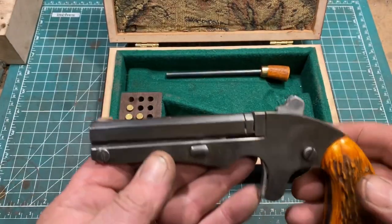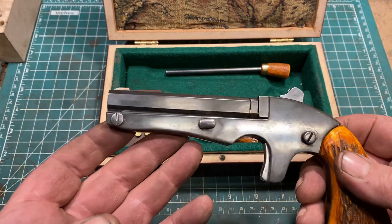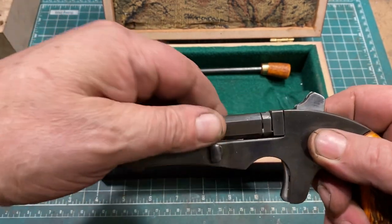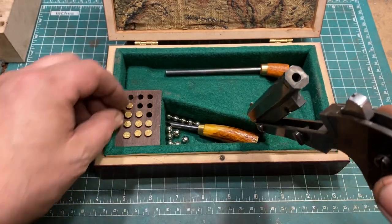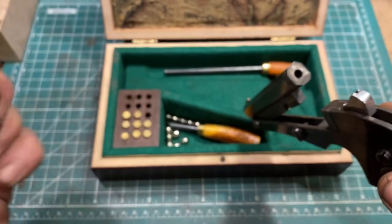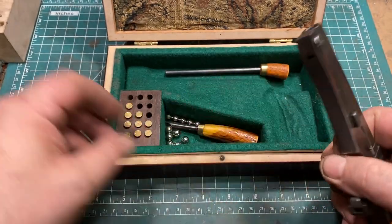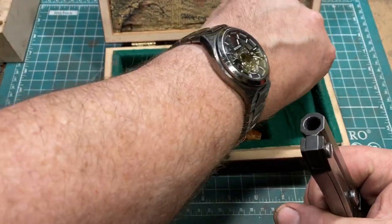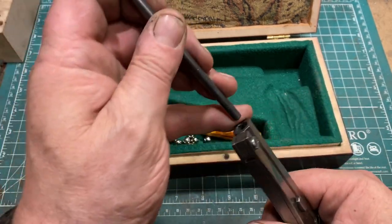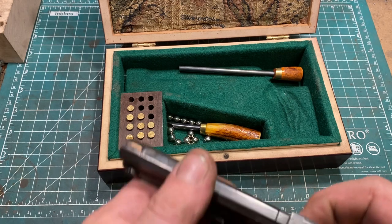What this is: I had a section of .312 inch barrel from an old Mosin-Nagant, and I created a firearm. It's on the safety notch — you rotate this 90 degrees, you can pop open the barrel, where there is a chamber for a .22 caliber ramset blank. These are number three blanks, and they seem to produce ballistics comparable to .32 Smith & Wesson Long. You put a ball in the muzzle, ram it in with the ramrod — which is cupped on the end to cover the ball — ram it in, insert the ramset blank, and then you can cock and fire the gun.